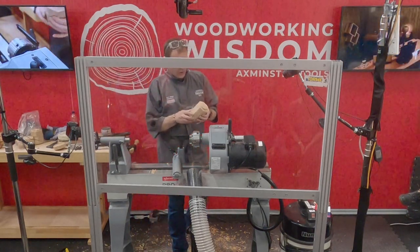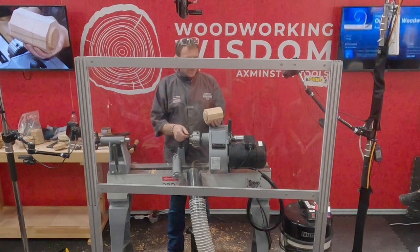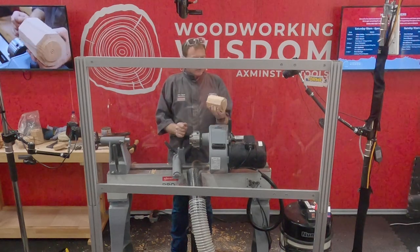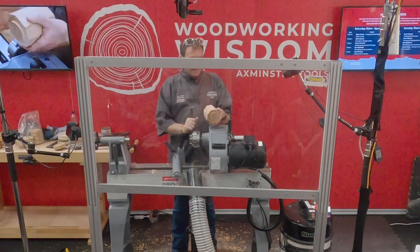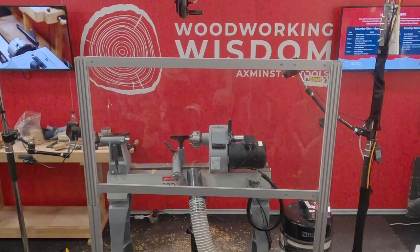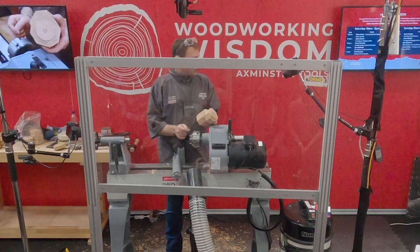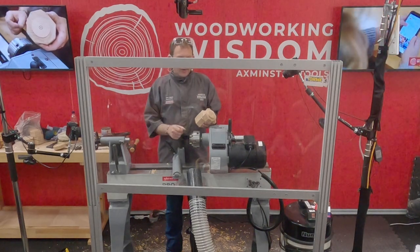I've done some prep. My blank is five inches long, 125 millimetres. I'll mount a spigot on either end, and I will have cut it to an octagonal shape on the bandsaw as a lump. I've got three lumps — enough for three boxes. To make the octagonal shape you're using the bandsaw to cut the corners off. The other important thing I use is a ring center on the tailstock — it doesn't break the fibres too much and does as little damage as possible when mounting between centres.